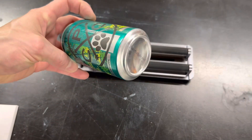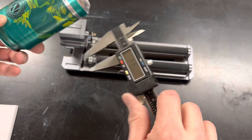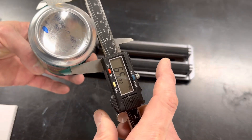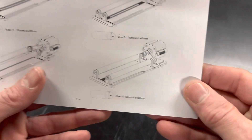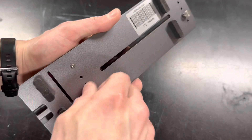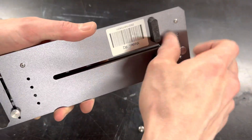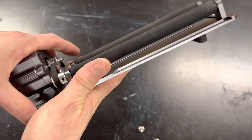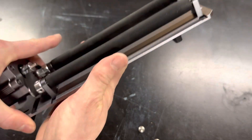You need to adjust the position of the rollers based on the diameter of whatever you're trying to engrave. I'm going to use beer cans for a lot of my test burns, so I need to first figure out the diameter of the beer can. Based on the chart in the instructions, I need to set the roller to its widest position, which is pretty easy by removing two small thumb screws on the adjustable roller.